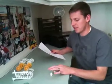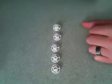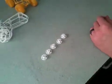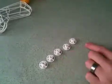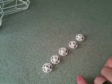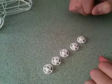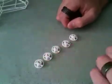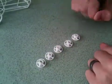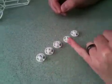So even if you go to 0.5 millimeters on parts like these right here, you're going to have an accuracy of 0.1, so that might move it up to 0.6 or 0.4 depending on how the model is printed. In this example, I made three wheels — actually five — and they are all exactly the same except the clearance between the wheel and the axle is different: 0.7 millimeters, 0.6, 0.5, 0.4, and 0.3. I printed them all out just to see the difference between each clearance level.